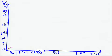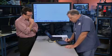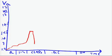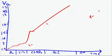So now we're going to use a method where we're sending that trickle current and starting to ramp up into the signature detection phase — we need an absolutely positive way to detect this. Once we detect that it's a powered device, a PD, then we send it full power to see if it will hit it. We know it's at least AF, so we can send AF power. Once it detects it, it will clip it and drop it down to 6 volts if it is an AT, a higher-end device. The device will then say, just to make sure, let me send you AF power one more time. Test it again — once it detects that again, it will clip it, drop it back down to 6, and say, that is an AT device, go ahead and send it 25 watts. If it never drops that off, that's an AF device — send it 15 watts, and then let's use the enhancements.